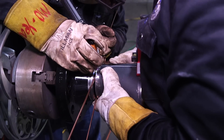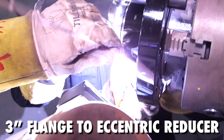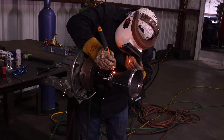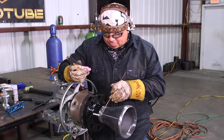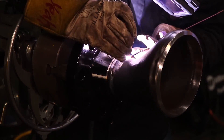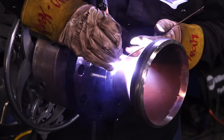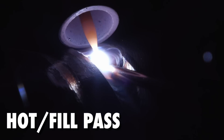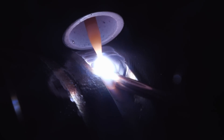Alright, that looks good. I got all my stuff and starts grinding down. I like to feather them pretty good, that way when I tie in they fuse nicely. I'll start about a little tack, kind of warm her up. Once I get to that edge I'll start feeding some wire, going back side to side, getting each side of the bevel, watching my puddle. Going into my tie in — go down a little bit, hold, make sure it fuses, a little past. Trying to get as even of a feel as I can. Walking and feeling, walking and feeling, push that wire. And into my tie in, go a little past it.